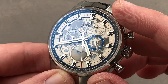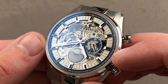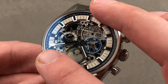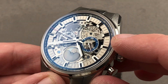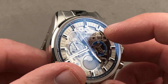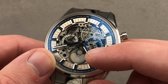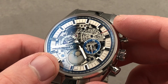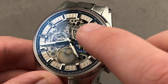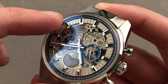The dial is a maze of amazing textures, tones, materials, and finishes. Outboard there is a blued seconds and minutes track against which you can read fractions of seconds, whole seconds, and minutes. The inboard track with hours and minutes features a lovely satin grain, satin brushed across its surface, with individual applied and cantilevered rhodium-plated steel indices. Moving inboard, there's a second sapphire underneath the primary sapphire — the dial is printed on sapphire, so El Primero seems to float over the works. The caliber underneath, reference 4047, drives an AM/PM indicator, a moon phase, a chronograph, and a double-digit date. The movement is gorgeous with satin finishing across its base plate, blued screws, and some underlying springs and the terminal end of the drivetrain visible. The bridge around the balance and the terminal end of the drivetrain have been hollowed out to make them visible from the dial side.